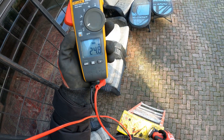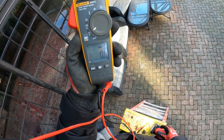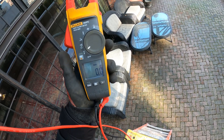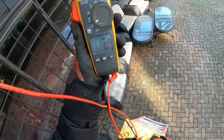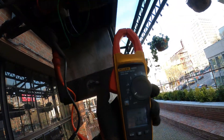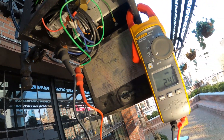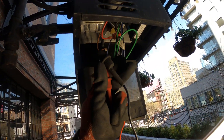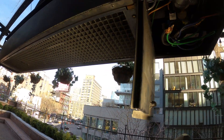I'm sending my helper to go turn off the power and have him turn it back on after about five seconds. All right, got power. I tried three times and nothing — I've already turned the power off. I know these ignition controls go bad all the time. We're getting our 24 volts but we're not getting ignition.